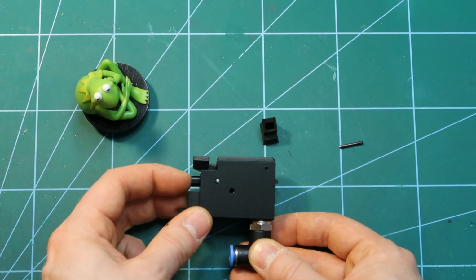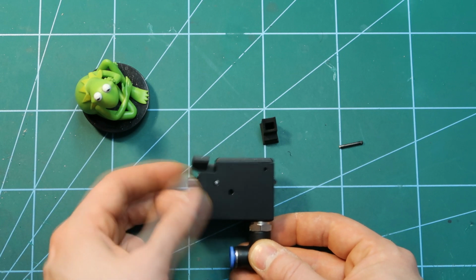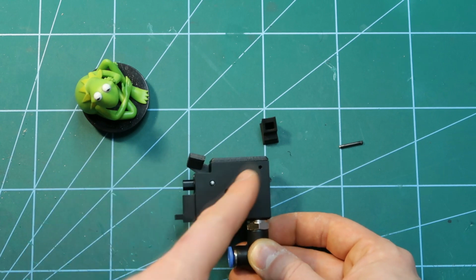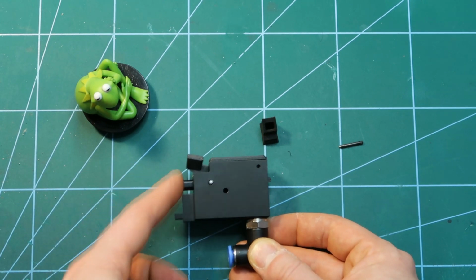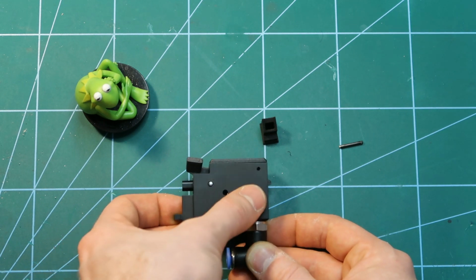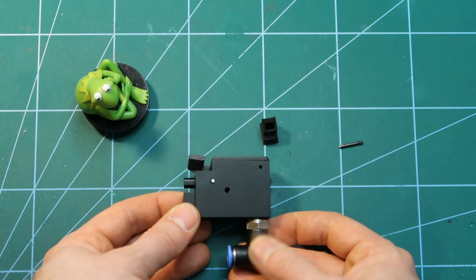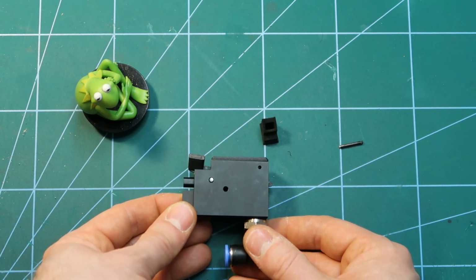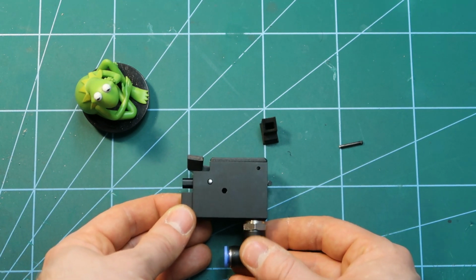In case this is pushing too strong on your valve and the valve doesn't close completely, just file off the rear portion of this part and put it in, and when it's shorter it will not push so much against the valve anymore. Now just remember to clean everything up, remove any sharp edges after any potential filing, and relube everything.